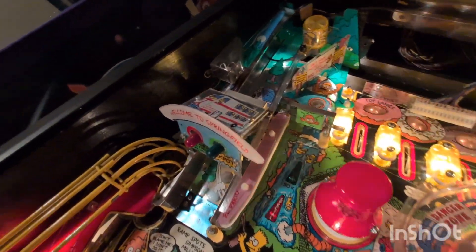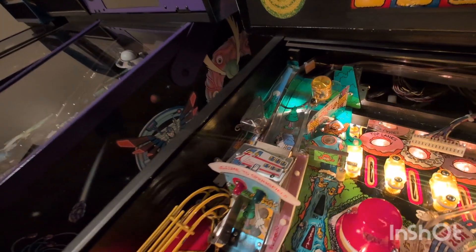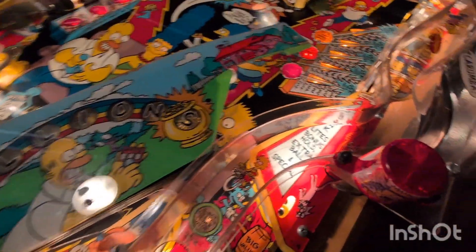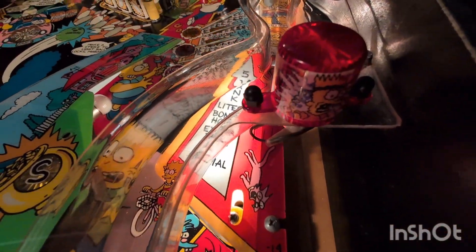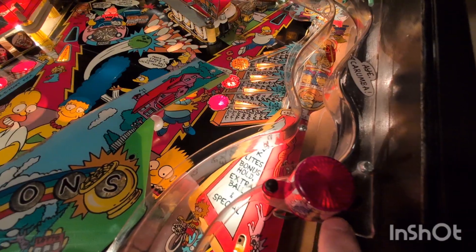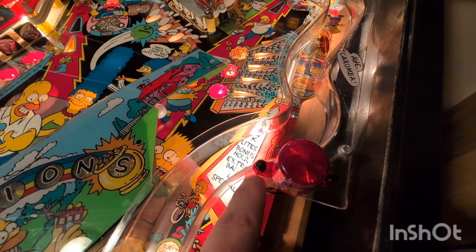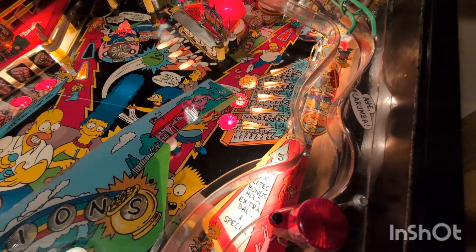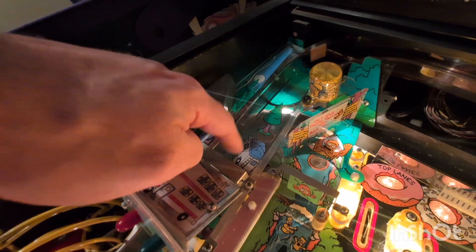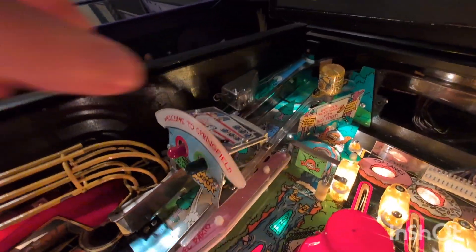There are a lot of things mounted on this ramp. I'm going to try and transfer all the factory decals — Jody outlines a freeze spray method where you can break the adhesive, clean it off, and then use 3M transfer adhesive to put them back on. There are also decals on all the flasher domes, so I'm just going to reuse all the flasher domes. Jody had an option to install new flasher sockets. There's also an exit ramp switch, an entrance ramp switch under this gate, and the light for your jackpot or shoot twice for mystery value — that assembly is going to have to come with us too.